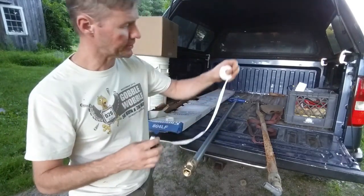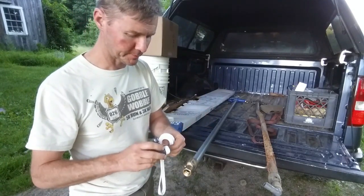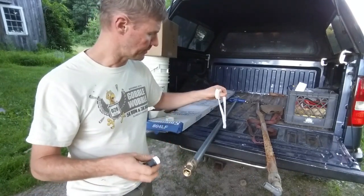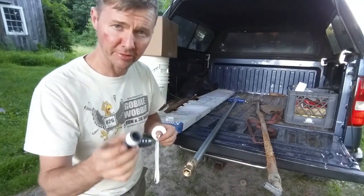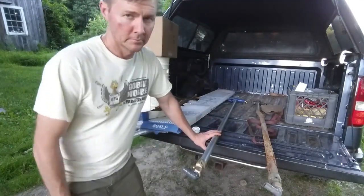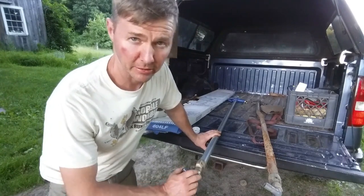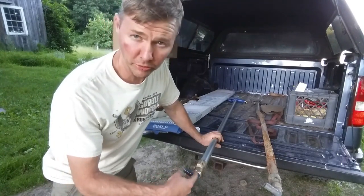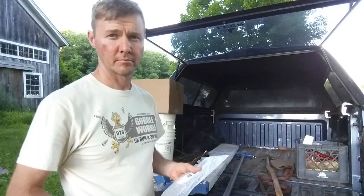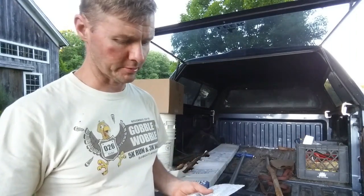You don't have to be a pro to take care of yourself — that's kind of my motto. Also just be aware this is a standard pipe fitting with a tapered thread, in case you didn't know. I didn't record spinning it on, but doing it by hand I get to the point where if I had to go another full revolution it would be too tight, so I stop right there.